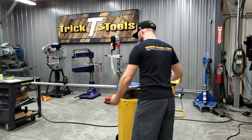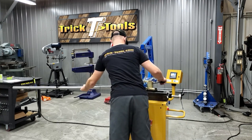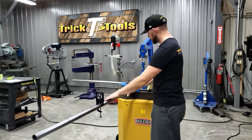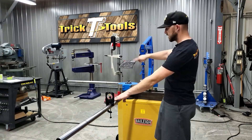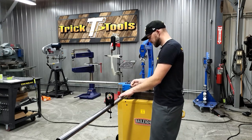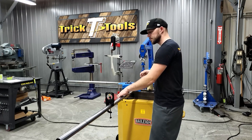We went with 95.5 degrees, keeping a little bit of back pressure on this to keep it in the die. There's our first 90-degree bend. Now I'm going to flip this over — because I marked these lines all the way around — and line it right back up to bend the next one.